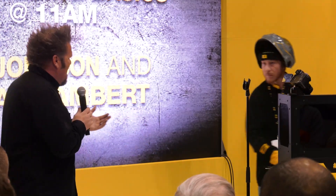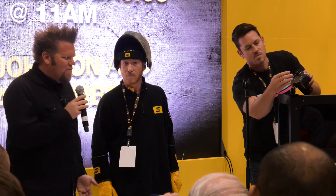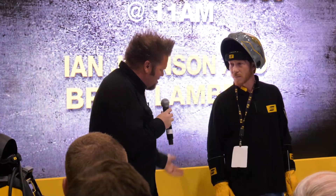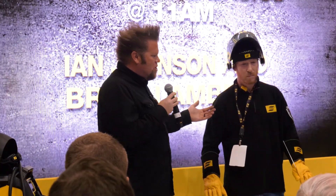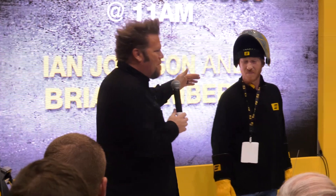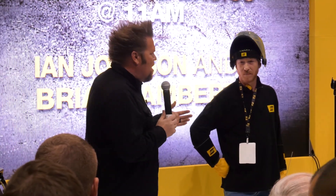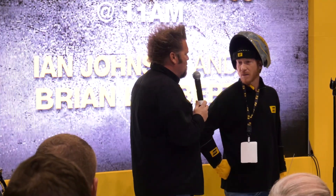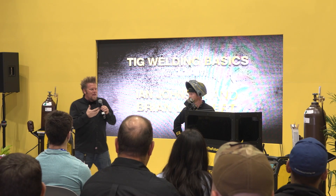We're going to talk a little bit about PPE — personal protective equipment. Even though when you're TIG welding there may not be a bunch of sparks jumping up to hit you, you'd still want to wear long sleeves unless you want a sunburn. Proper PPE includes leather gloves, a long flame-resistant shirt, and a helmet. You want to have the proper PPE whenever you weld. Depending on the application, you may end up wearing a respirator or some type of clean air system — especially if you're doing a lot of aluminum welding in an enclosed area.